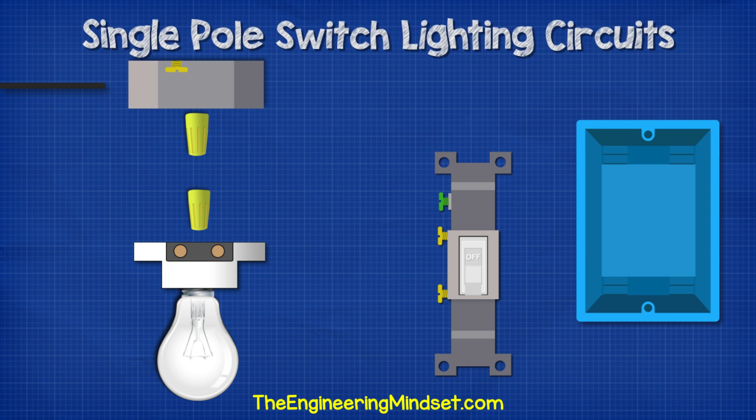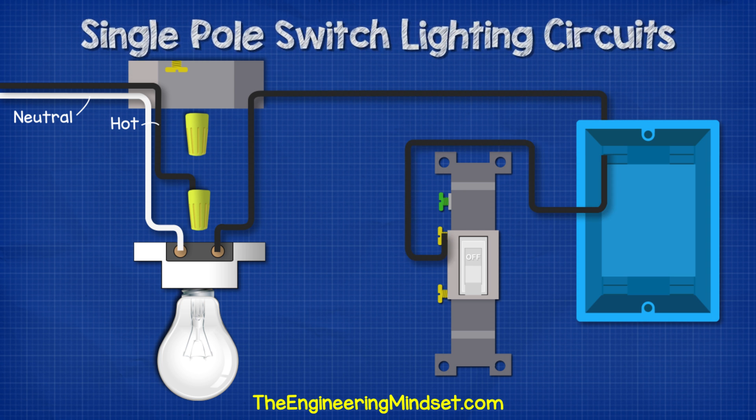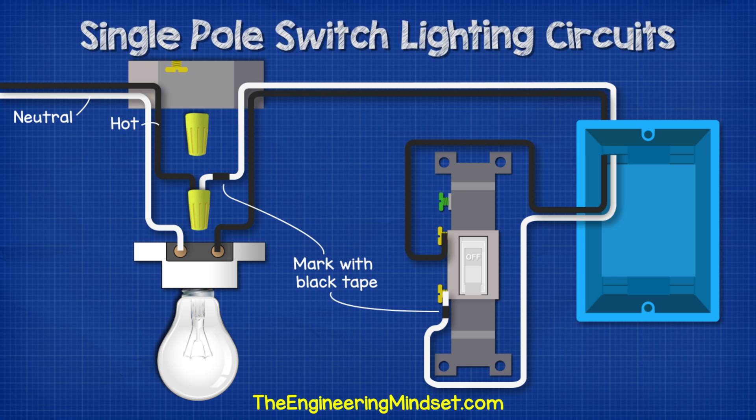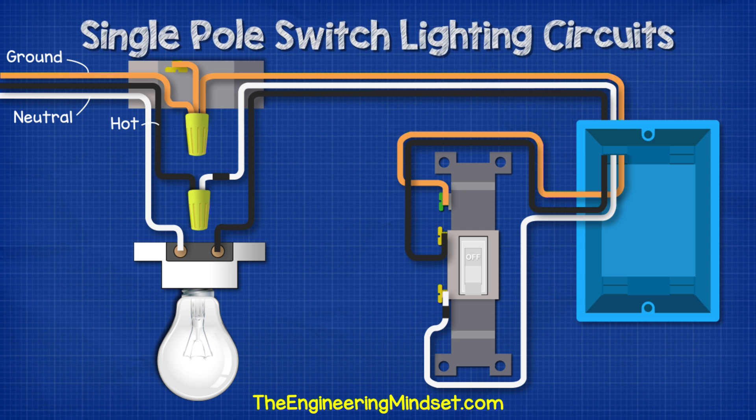With the power off, we connect the hot wire into our wire nut within the ceiling box. We then run the neutral wire through the ceiling box and into the light fitting. Then we run a black wire from the light fitting, pass this through the ceiling box and over to the switch box, and connect this to the top terminal of the switch. Now we run a white wire from the bottom terminal of the switch and connect this into the hot wire nut within the ceiling box. This wire is going to act as the hot wire, so we need to mark this with black electrical tape to warn anyone about this. Now we bring our ground wire in and connect this into the wire nut within the ceiling box. We then connect the metal ceiling box into the same ground wire nut. Then finally, we connect the last ground from the ground wire nut through the switch box and into the switch ground terminal.